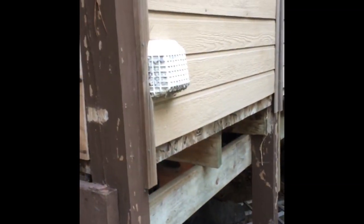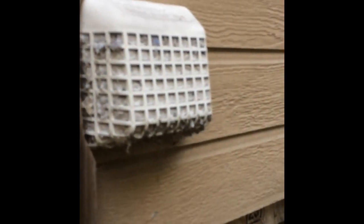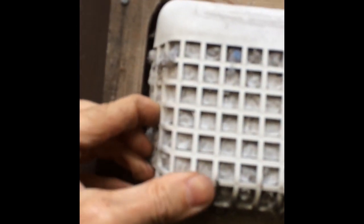Here we have a dryer that isn't drying very well, and we changed the primary and secondary coils. It's still cycling too short, and we can see that this trap over time is almost totally obstructed all the airflow. So we'll just clean that up. It'll be a big difference.